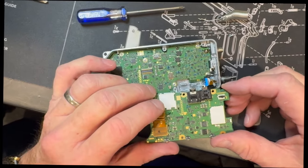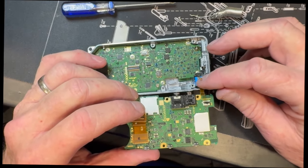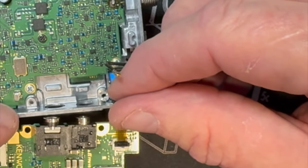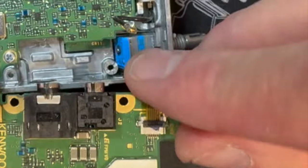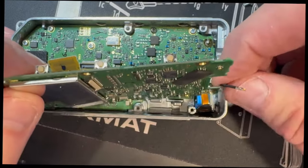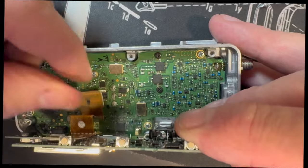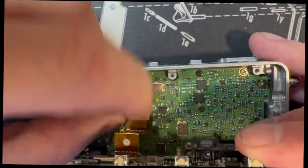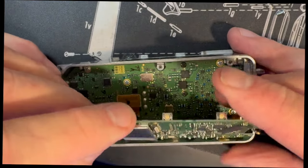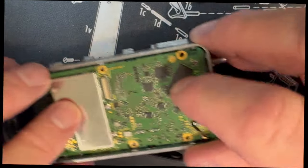On the 74, you had to connect the antenna to the board at the same time as feeding in the encoder ribbon cable. On the 75, you don't have to do that. Be very careful when you put this in — snug it up until it doesn't move, then put that stay on. When you bring the board over, be careful not to pinch the GPS antenna wire, and go ahead and snap the ribbon cable in. Make sure it makes a distinct snap.